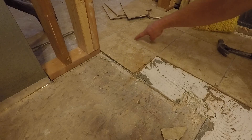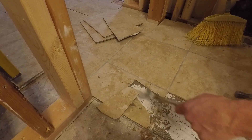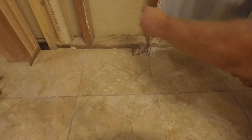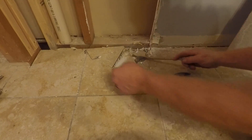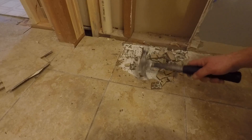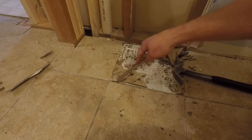You can see I get some grout stuck in there so I'll have to remove this one as well. It's just a matter of going through and chiseling out. Some of them are stuck better than others, and those that are stuck real well are just going to have to be broke and I'll have to come back in with my new tiles. This one has a chip in it so I'm going to have to remove it. I chipped that one right there on the end, so I'll have to remove that one as well. Since this one's already broke I'm just going to use the hammer and chisel it out, trying to hit the force away from the other tiles that I want to keep.